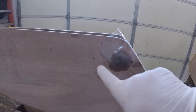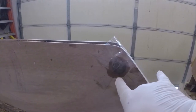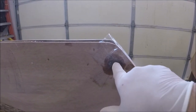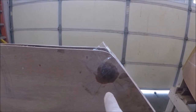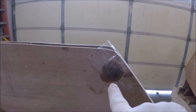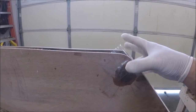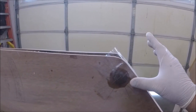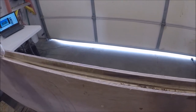I carefully marked the centerline — this is the pivot hole where the rudder will pivot inside the dagger box. And I drilled it out with about an inch and a quarter Forstner bit. I was careful to drill through with a real small bit first, drilled most of the way through from this side, and then finished it up so I wouldn't have a big blowout on the outside. Then I put tape on one side, filled it up with epoxy slowly, and taped the other side. Normally I'd just let that set and cure level nice.